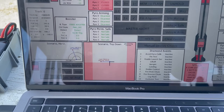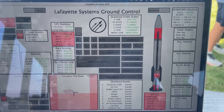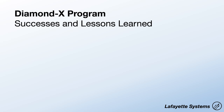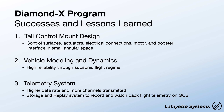But there were some problems. I wasn't recording the telemetry packets that came down — I had to restart my ground control software, which means I lost the data from those last few packets that may have told me exactly where the rocket was. I clearly have some things to improve with my ground control software and how I design two-stage rockets entirely. Nevertheless, I have learned a lot over these last six flights. I refined my tail control mount design, and I can squeeze aft control surfaces, electrical connections, and booster mechanical interfaces into a really small area. All of that flight data has helped my modeling of vehicle dynamics, and it's now pretty reliable even up through high subsonic speeds. My telemetry system is more refined, and since this flight I've implemented a storage and replay system so I can play back flights and analyze data even if I lose a rocket.